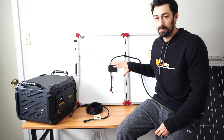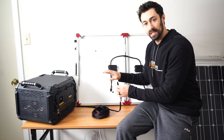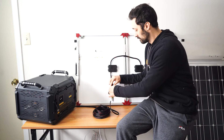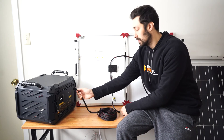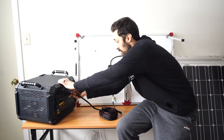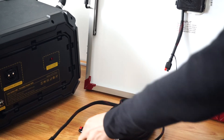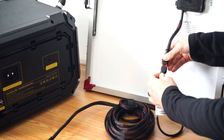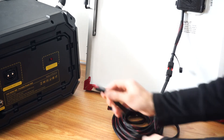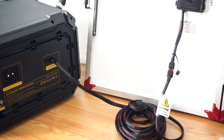You're left with this first panel now. What you'll do is connect your extension cable into the first panel, snap it together like this, and then the extension cable goes into the back of your solar generator and you're done. You've connected your panels together in series, and then from the first panel the short piece will go into the extension cable, which then goes into your generator. Put your panels out in the sun and you're done.